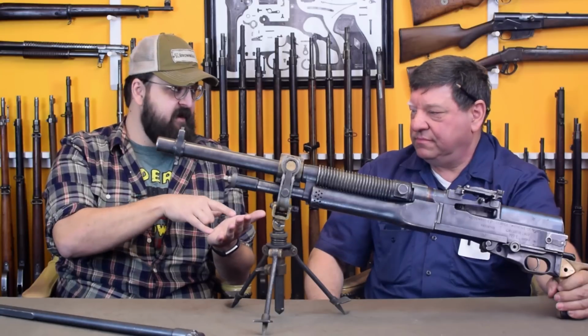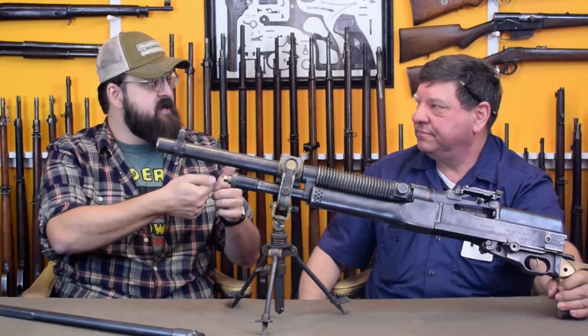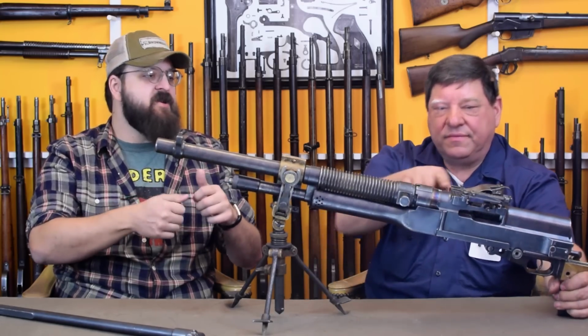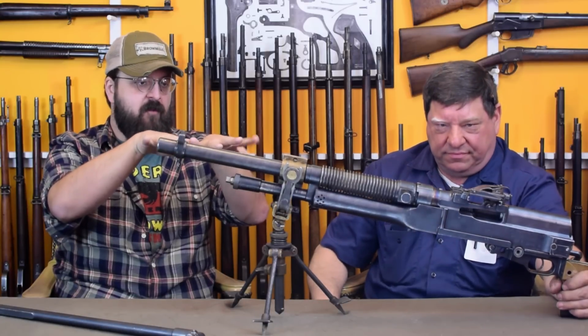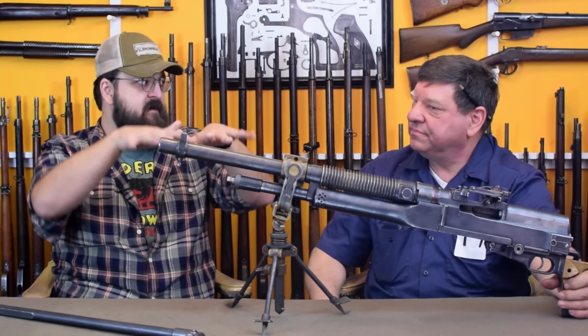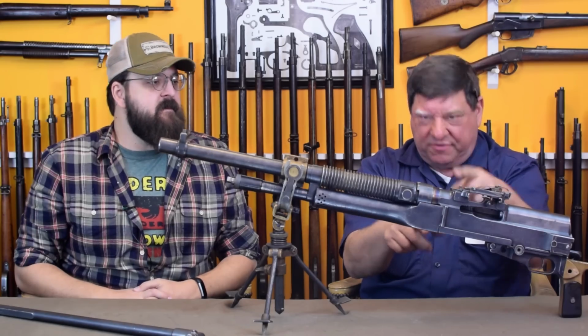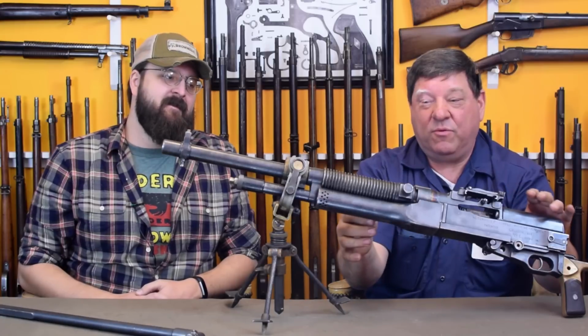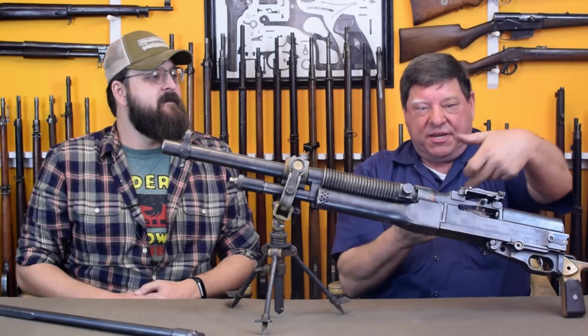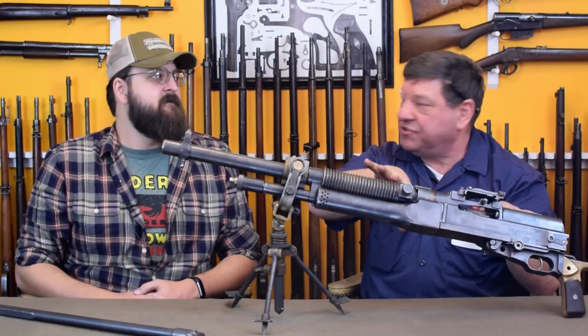But every once in a while, one of the outside tabs would get loose, and we'd have a twisted cartridge jam. And then the other big one is if any of the leading edges got tabbed over, the leading edges have to be level. They cannot be warped or twisted, because by the time you get them lined up in there, if you got any sort of weight to one side or the other, it ties up the feed again. There are 2 fingers sitting in here that the strip goes under and the cartridge goes over. And if there's any disruption in that leading edge, it's horrible. And there's no way to get out of it.